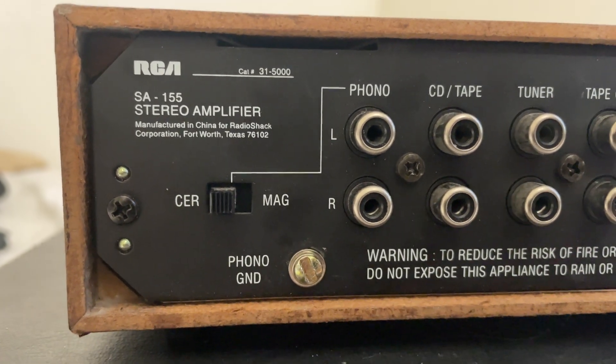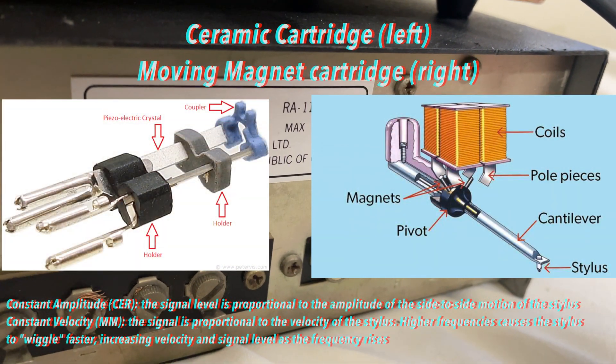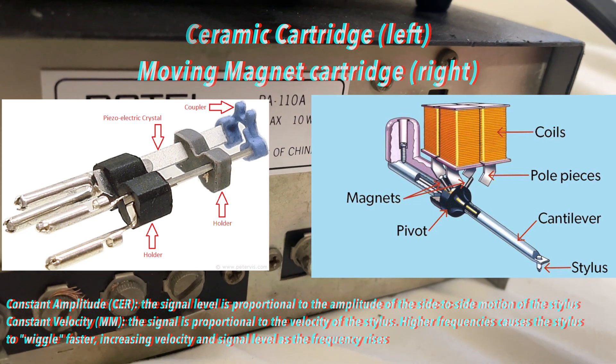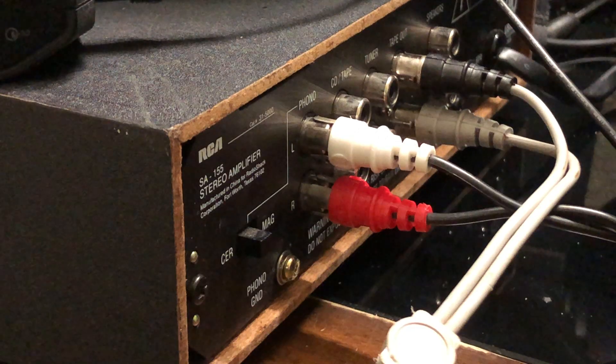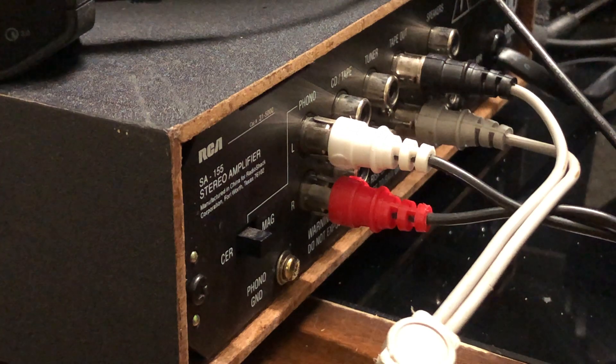That passive circuit was just a capacitor and a couple of resistors — just enough to do the conversion from amplitude response to velocity response. Ceramic cartridges are constant amplitude devices while magnetic cartridges are constant velocity devices, hence the need for a velocity equalizer. This is not a one-size-fits-all solution, but it works depending on which ceramic cartridge you use. I'll be using the AOE CP38S ceramic cartridge for this test, and you'll hear the difference between the Rotel implementation versus the RCA implementation.